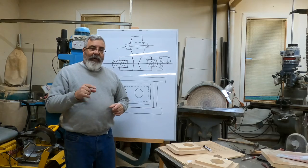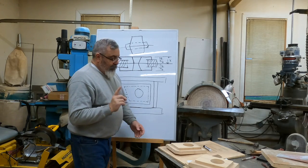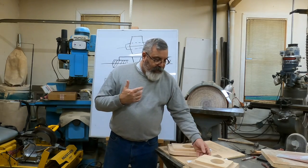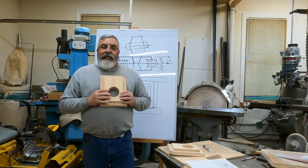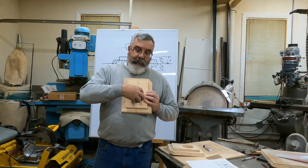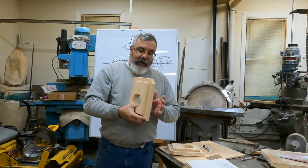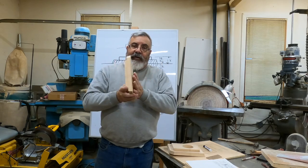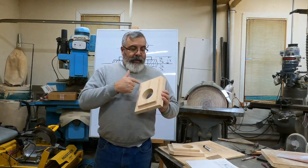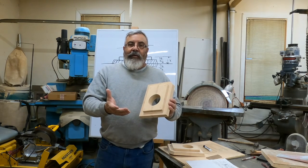That's all it is. So we're basically going to have the core be a frame. Now, when you're looking at this pattern, when we make this mold, there's going to be a piece of sand that's going to protrude down, and actually it's going to be a cope half, drag half. They're going to kiss together in the mold, okay? Well, I don't have a core in there that's going to get in the way of the core, right?